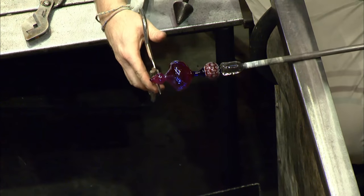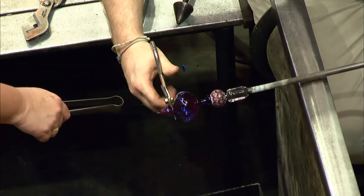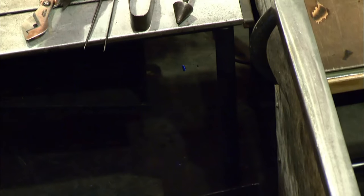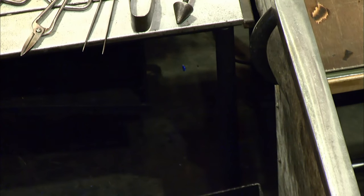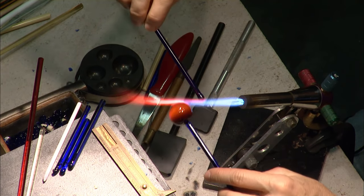And then the two green and blue knobs are oxygen. The knob that is horizontal is a surface mix oxygen. And then the knob that is straight up and down, face towards me, is an internal mix oxygen. So oxygen, oxygen, and fuel.